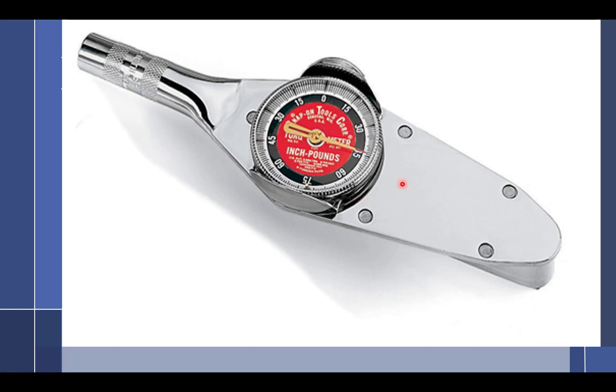Torque wrenches should be calibrated at least every year. When I built engines, I calibrated my torque wrench at every setting change. That machine that's in the lab, that's the one I had. It's literally that one. I took it. They're not using it. I had it on a bench, building engines right here, and 6 feet away was that. So I would read the manual. It would say, okay, you're going to torque this to 300 inch pounds. I would change it to 300 inch pounds, go over here and exercise myself, my elbow, my tool, until I was consistent at 300 inch pounds, and I'd walk over to the engine and torque everything to 300 inch pounds.